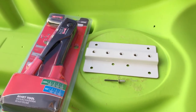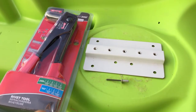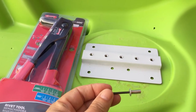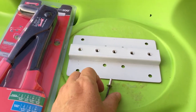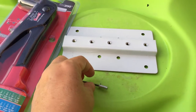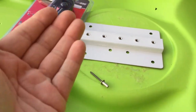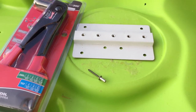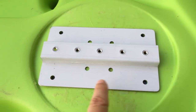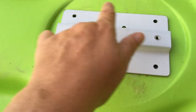The next option is using a rivet and a rivet gun. I'm trying a 3/16-inch rivet, and I'm also going to try a three-pronged rivet. It's a similar idea to the well nut — the rivet goes down through the hole drilled through the mount, and the rivet gun pulls on it such that the bottom part comes up and presses against the underside of the deck, again creating a good seal. You can use a sealant with all of these options. The mount has eight different holes, and four is probably sufficient — for today we're going to use the four outside holes, which I've already marked with a felt-tip pen.